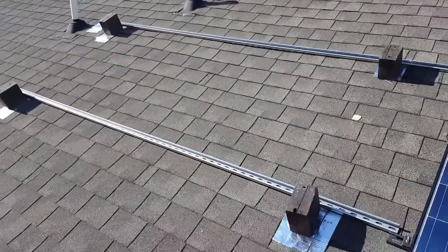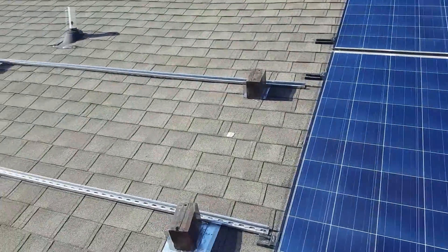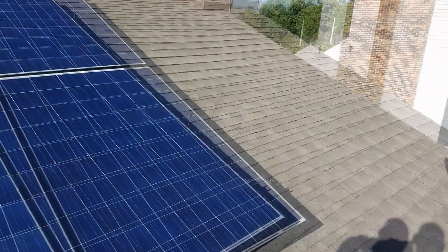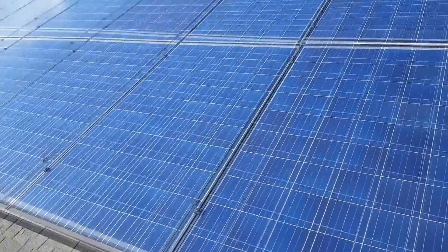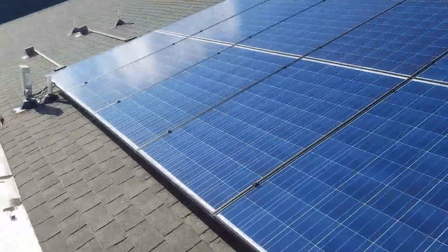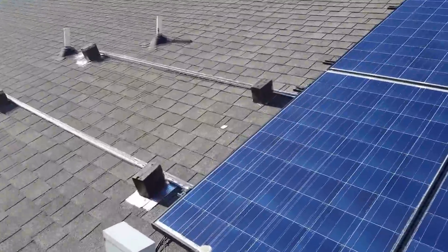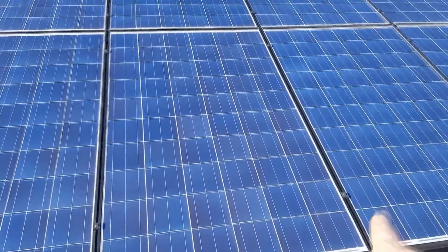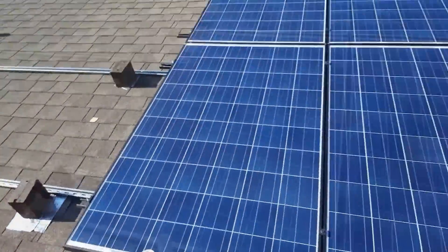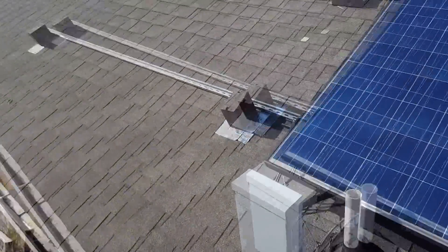I'll have five strings of 250-watt solar panels — that's 3,750 watts total. I've got a feeling I'll be sending off my Midnight Solar charge controller. Currently everything's working almost up to par — it used to be more power. What I'll do is test the watts on the output on one string, then test the watts on the other, because all these strings put out the same amount of power. When you turn on the charge controller, I noticed it jumps up and down.